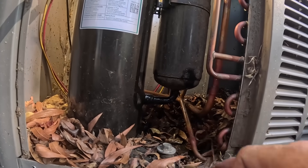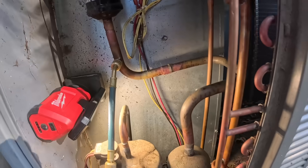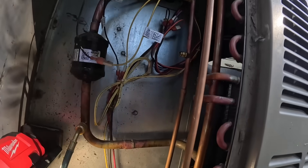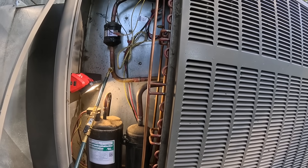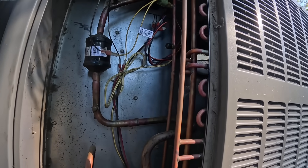And that looks like a 3/8 going to my condenser — that is my hot gas line coming off the top of the compressor. Or is it? Nope, that's not my hot gas. That is my liquid line. So we'll replace from here up to here. That ought to be a fairly simple repair. I don't mean it's going to be cheap though. Alright, so we know we need to replace the liquid line and put in a dryer.